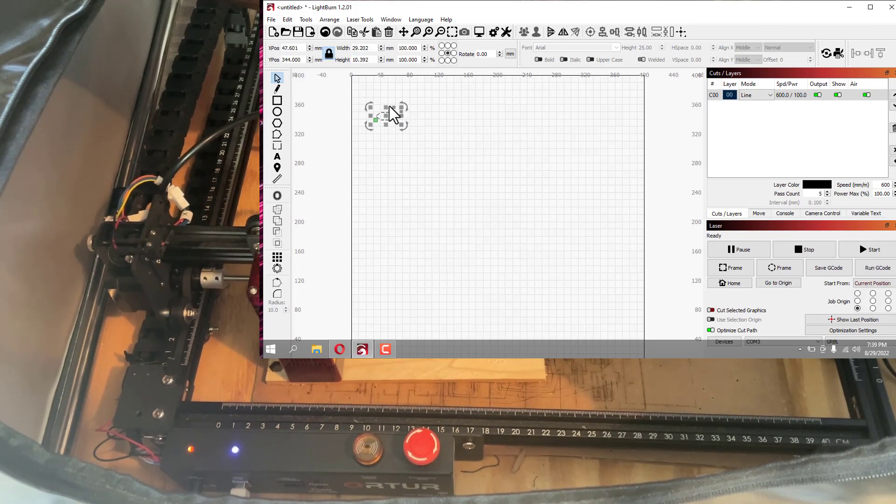I'm going to take that little hexagon shape and stretch it just a little bit so it's different, move it to a new spot. I've set up a new LightBurn on this old laptop — I'm doing origin zero-zero, a speed of 600, a power of 100, and five passes.